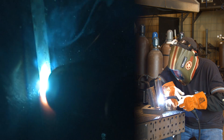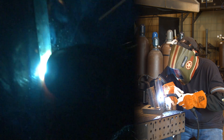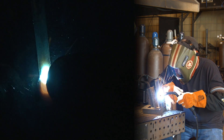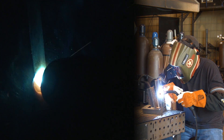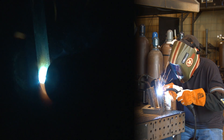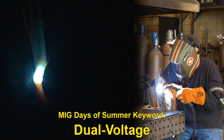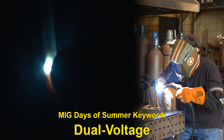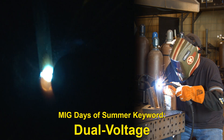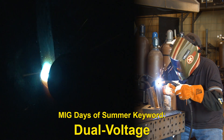To me this is looking a little ropey, but I can't do a whole lot about it. I have to run this hot enough to make sure I'm fusing in. If anything, I might be able to slow the wire feed speed down, but to me that'd make it slobbery and weird. Good crisp bark — I'm liking the sound of this.